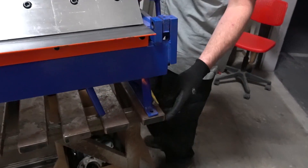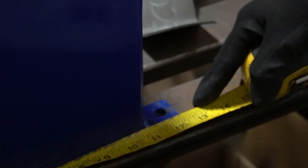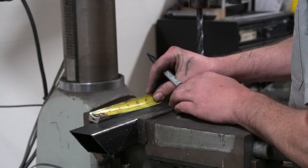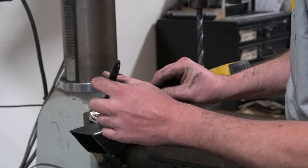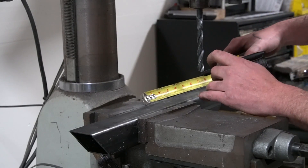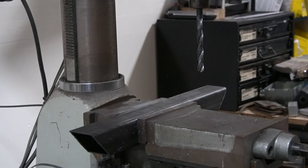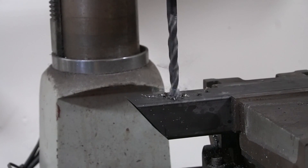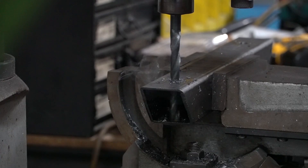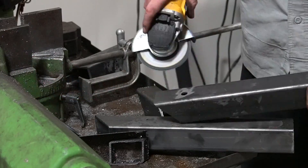We definitely need a way to mount our sheet metal brake to our stand. The best thing to do is measure our bolt holes, find the distance between them, divide by two, and mark out where they need to go. I measured both sides and they're the same on both sides, so everything's good. On our top piece, I'll measure out the center and then measure from our bolt holes from that center reference. I am going to oversize these holes just in case there's any imperfection or difference in the layout. We just need to make sure they line up, a little oversized from what they need to be, and we'll use a washer on top.